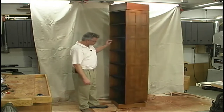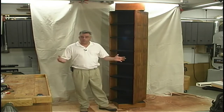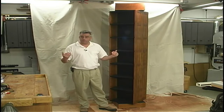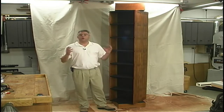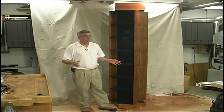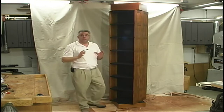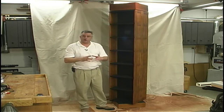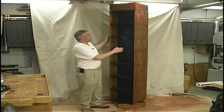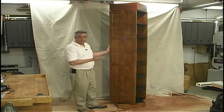As you can see, it rotates. The purpose of this rotating bookcase is to give you flexibility within your home as to where you can place it. Most bookcases have to go against the wall and be attached to prevent tipping. This bookcase can go anywhere in the room — against the wall if you provide enough clearance behind it, or in the middle of the room as if it were a column supporting the ceiling. The top rotates, which allows us to put a key — a simple square block attached to the ceiling joists — that drops down inside a recess on top, keeping the bookcase from tipping over.